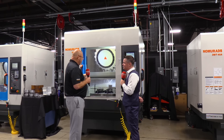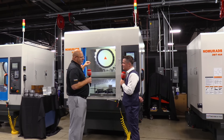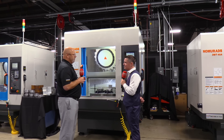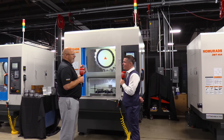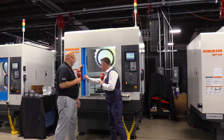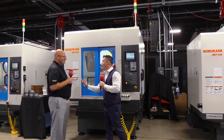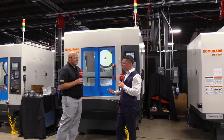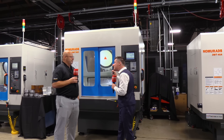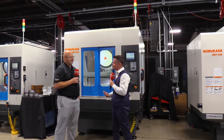When we're changing over in this style, the table is very, very rigid. When we put a side load and cut against the table, the Hirth coupling allows us to lock into place so we're not going to get any drift. Also, going back to throughput, it's going to increase our spindle utilization — from a standard VMC at about 65 percent, up to about 85 percent with the pallet changer, and then automation would get us to about 90 to 95 percent. That allows me to apply those heavier cuts because I'm having the resistance in the opposite direction.